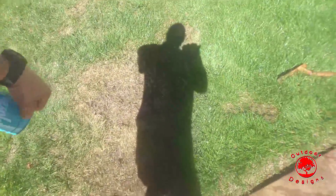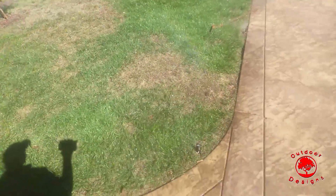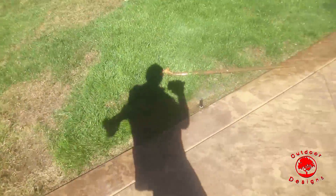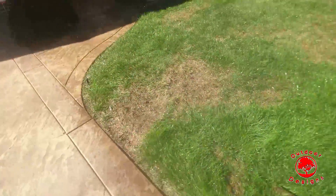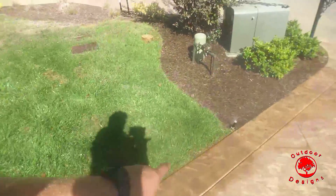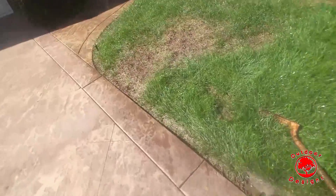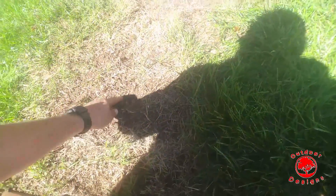Now we are getting throw over to here — it is soaking this cup. It already has the same amount of water we had previously in there and it's been on for five seconds. That little change in the irrigation system is going to change everything. This is going to be a deal breaker for this yard. We'll be able to grow grass here. That simple change means we're going to have grass here. We're getting great output on this side. I still want to change this van nozzle here, but for now that's getting it good. How about them apples? Look how moist that ground is already — it's working in there deeper than it did after six minutes of run time.